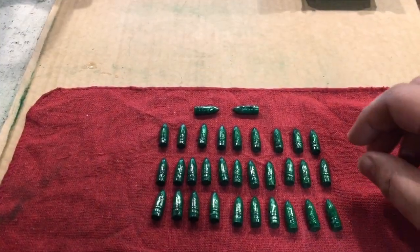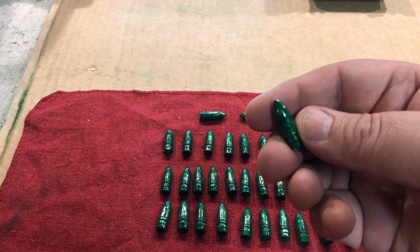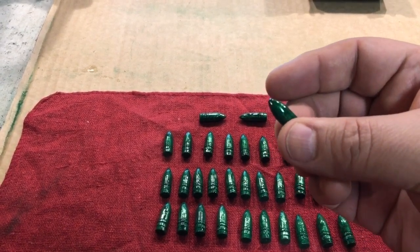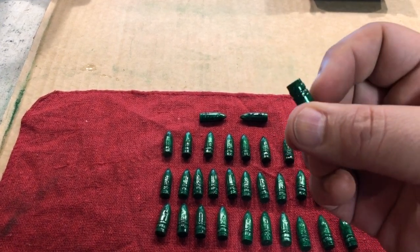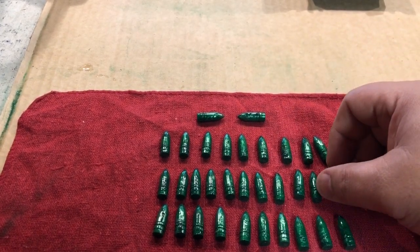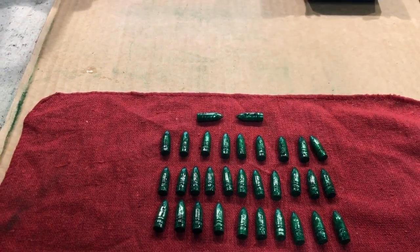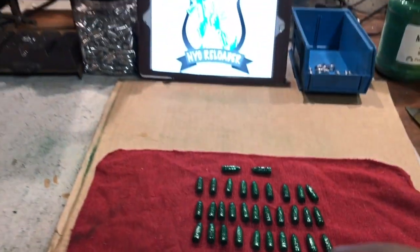Here's a look at the completed powder coated bullets. They look amazing — there's a lot of gloss and shine on them from the lights in here. They're very well covered with good flat bases and no overflow at the bottom, so I won't have a problem gas checking any of these. I didn't have a single one with a problem. At the end of the day these are all powder coated — I'll size and gas check them and then we'll be good to go.